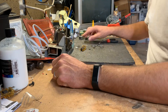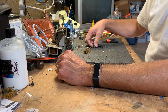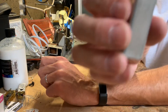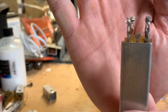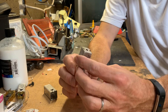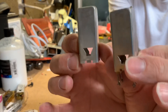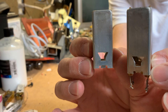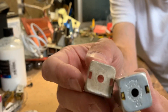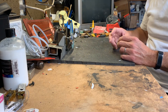I think the radio will work fine — it probably isn't absolutely ideal, but that's what I have and I want to get this thing working so I can give it to my friend. I'm going to switch the soldering iron on and clean up these leads, then put it back in and reattach everything. Got it cleaned up — I just opened up the holes and cleaned some of the solder off. This is interesting: the Philco that we're using to replace is identical to the Crosley. This one's stamped Philco and this one has Crosley part numbers on it — even the printing on the top is exactly the same. I think they were mass produced by only one or two companies and everybody started using them.